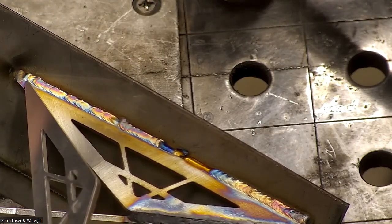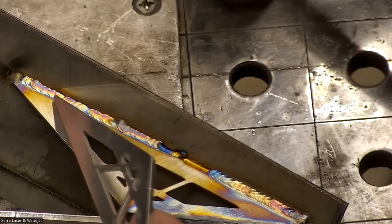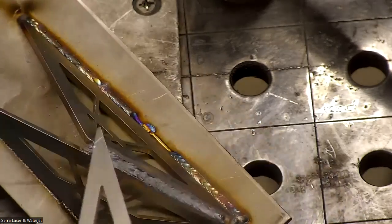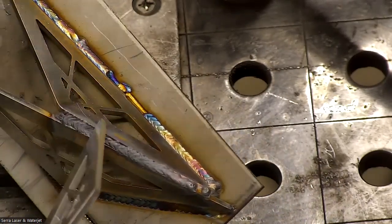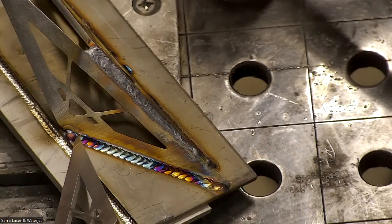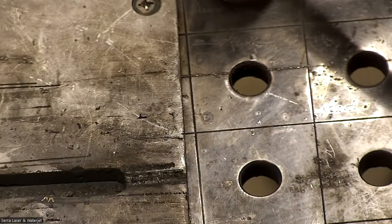This one I tried to just move continuously but stayed slightly hovered off the surface and let the wire feed in, so I wasn't letting the wire push me back — I was letting it build up as I moved along. This one got overheated because it's an outside corner with little windows so it gets hot really quick. I started with about an eighth-inch gap and moved down to no gap. This one I went along with a pause-move-pause approach, which I'm about to show you.